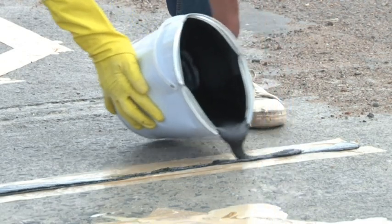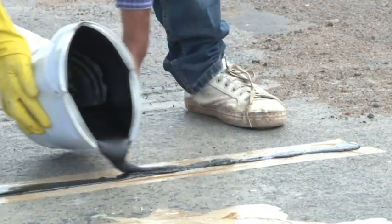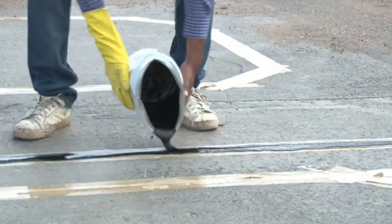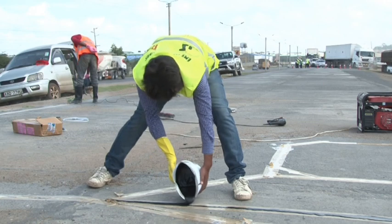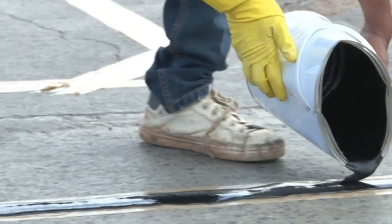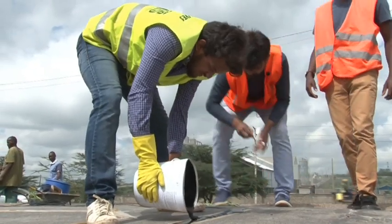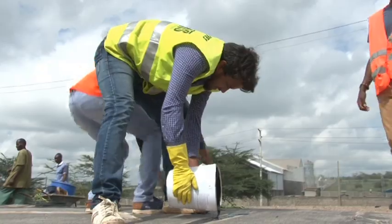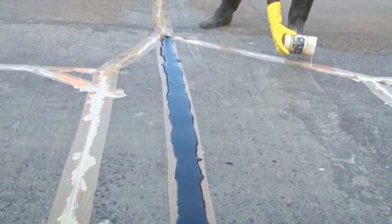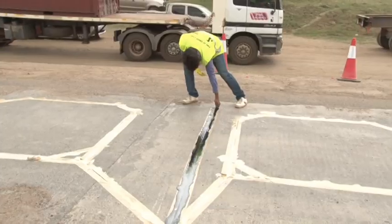Go three to four rounds and let the resin compound go down slowly. One container of piezo resin is enough for six feet. We remove the tape after five to ten minutes, depending on the weather condition of the site. The process of drying the epoxy is known as curing. Epoxy curing time is one and a half to two hours depending on weather conditions, and the resin setting time is only 30 minutes. Remove tape as soon as grout begins to set.